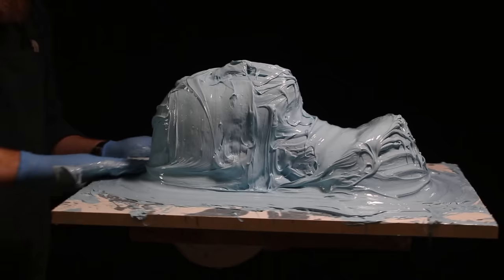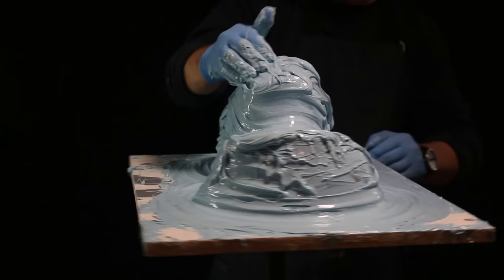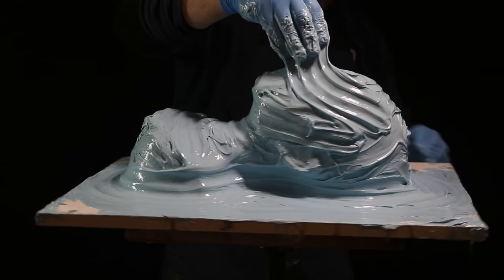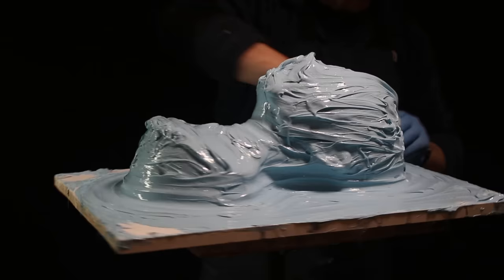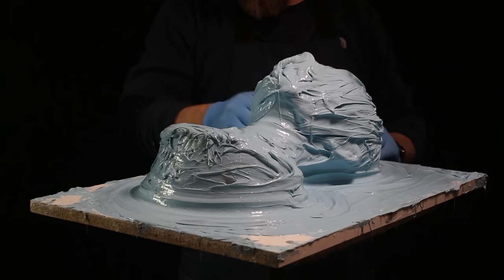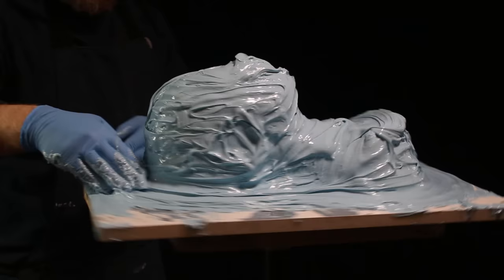It's very hard to see exactly how thick it is everywhere because it's opaque, so you have to do it by touch. Put all the silicone you've mixed onto the head, then smooth it out to an even thickness all over. If you feel the hard bit of plaster underneath, you've gone too far and need to scoop some up and cover the high points. The high points — like the nose, chin, and the ridge around the collarbone — tend to be the thinnest areas because they get wiped clean more often, so make a special effort to cover them.